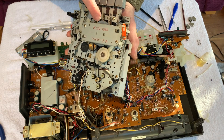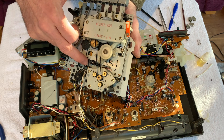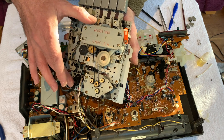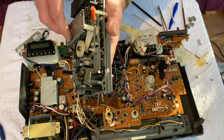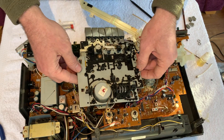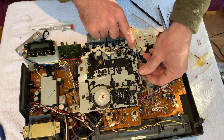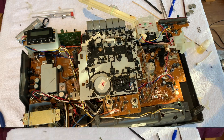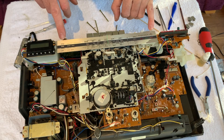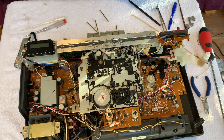So we've greased the flywheel, cleaned the capstan and the pinch roller, cleaned the running surfaces, put a new belt on, cleaned the play switch, put some rubber renew on the idler tyre, checked the condition and functionality of the counter belt, and a couple of other bits. Cleaned the heads too - I think we're good to go. Now we've got to very carefully line it back up onto the four screws and check the cable runs. The cassette mechanism is now back in, the light panel is on, the dial gauge is fixed securely, and we've put some fresh cable ties back in for the cable management.